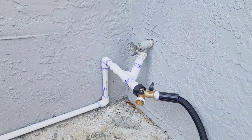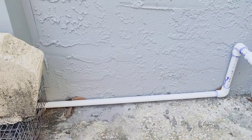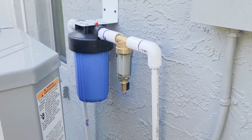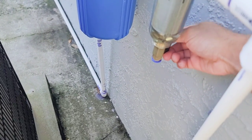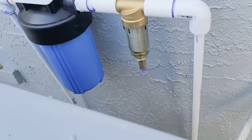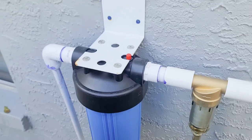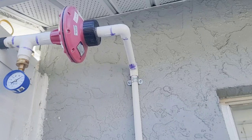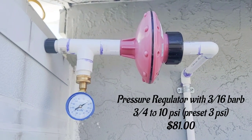What I ended up doing was attaching the system directly to the city water we have here. I came out of my main hose from the house with a PVC fitting — half inch — and I looped it around the side of the house before going into the bird room. I added two filters. The reason for adding these two filters was just as a precaution. The city water here is very clean, but every once in a while if they're doing work or whatever the case may be, you don't know if you're going to get any sediment. There's also calcium buildup that could form. So these two filters protect the entire system. From the filters it continues up and goes into the pressure reducer — and this is an Edstrom pressure reducer.